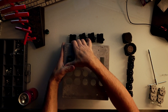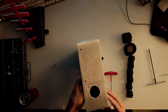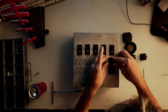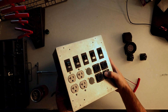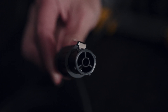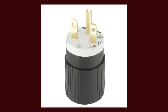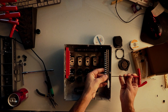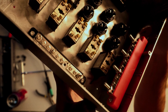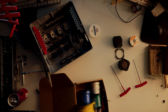We're going to start by popping in our five 20-amp breakers. These are panel-mount breakers, and we've got standard 20-amp Edison outlets. For our 240-volt 20-amp standard, I'm opting to use TrueOne PowerCon. These are tried and true, already used a lot in our industry. Inversely to the NEMA 240-volt standard that can be easily kicked out, these are locking and weatherproof. In every single situation in this project, that's the type of connector I want — locking and weatherproof.